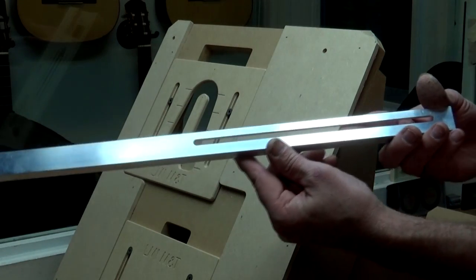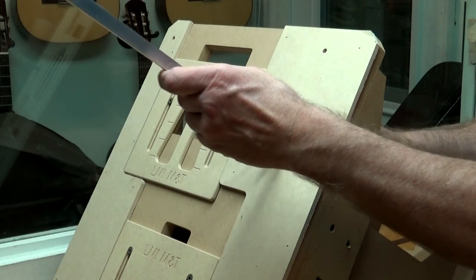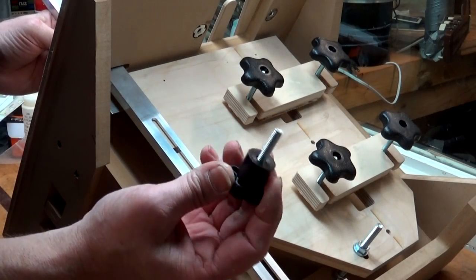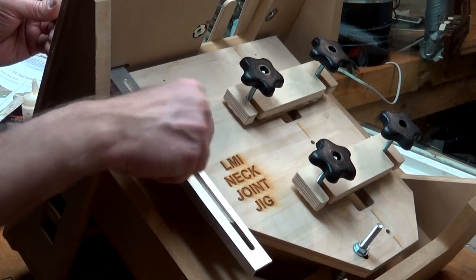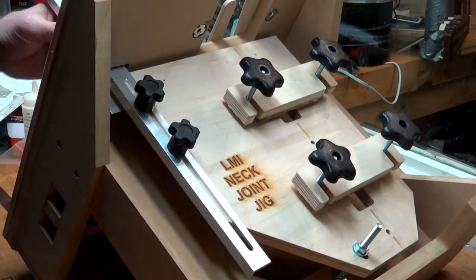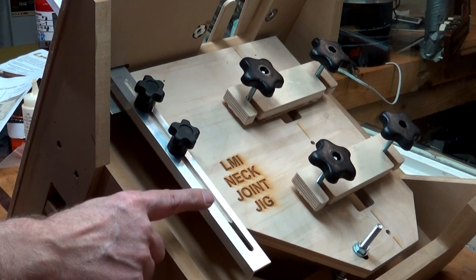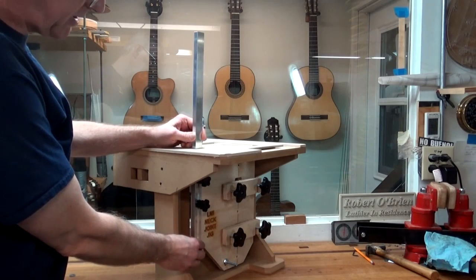To help set the neck angle, the aluminum piece comes through the top of the jig, comes down like so. Then on this side of the jig, use these knobs with the studs to secure it to the shelf. The slotted aluminum extrusion height can be preset to the bridge distance to simplify the measuring and setting of the neck angle. Just loosen the knobs and then raise and lower the aluminum piece to get the measurement you want